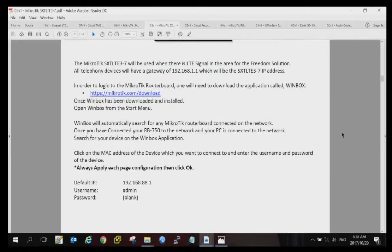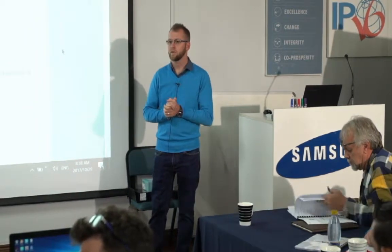Is there a distance limitation with the PoE cable? Yeah, default Cat5 cable, you're looking at 96 meters. It depends on your injector? No, still 96 meters. It's 96 meters because you have to take into consideration between your patch panels and so forth as well, your fly leads.